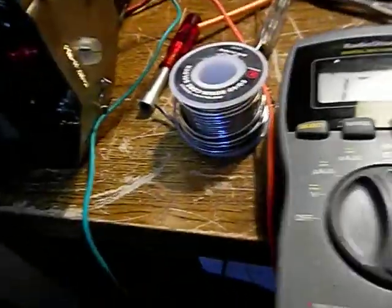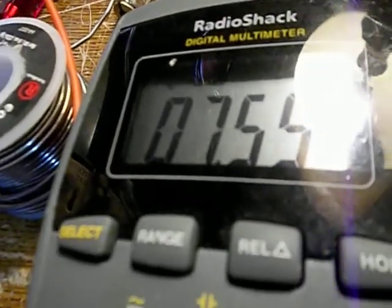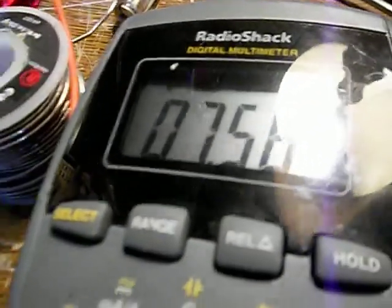Unclip the yellow lead. And now I want to make sure that ground wire really was hooked up. I'm going to ground out my convergence. This transformer is slightly different. It had an orange-white where the other one had a red-black, but other than that it was identical. No change. I'm going to unhook it. No change. Perfect.